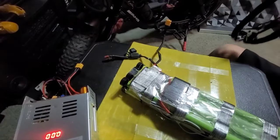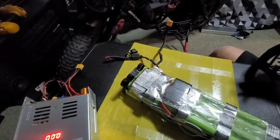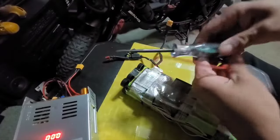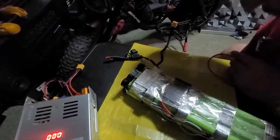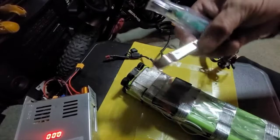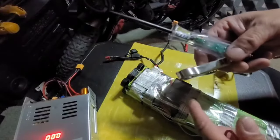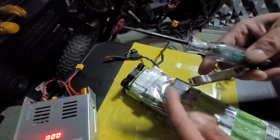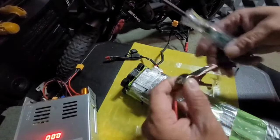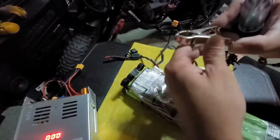What I'm using to test this battery right now — you can use a lot of different things, you can use a multimeter, anything that you can test voltage with. Right now I'm using a logic probe, old-fashioned logic probe. I dropped it on the floor. Normally this logic probe had a ground clip and a positive clip. It is a logic probe, meaning it doesn't just work off a ground and 12 volts at the tip like most test lights. A test light just uses a ground and tests for 12 volts. However, test lights can short car systems out.